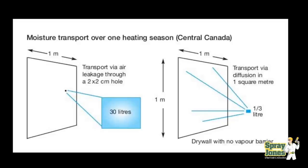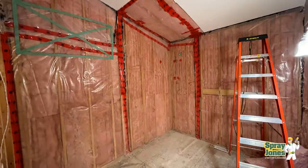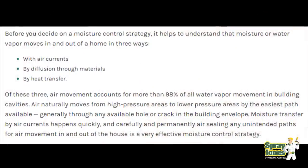In Canada the vapor barrier idea shifted to: now we need to incorporate what we call an air barrier. We're more interested in stopping the air, so we're going to go to a thicker piece of plastic that can handle flexing, movement, and twisting. But the problem has never been solved — not from 1960, not the 1970s, not the 1980s, and certainly not the 1990s and 2000s. Water in a wall is detrimental: it gets fibrous products wet, and once they become wet they become useless.